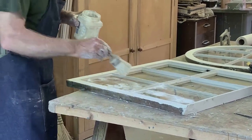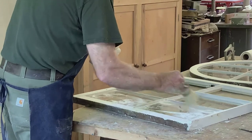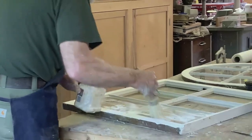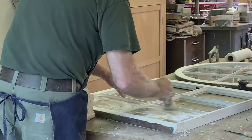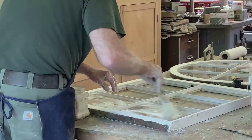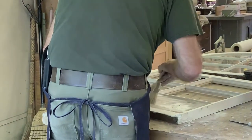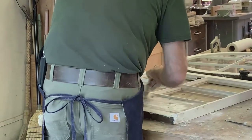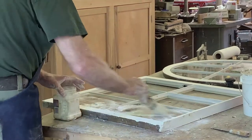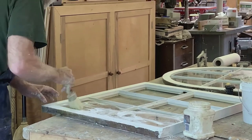This is the whiting again. You do this to dry the linseed oil, and you can't be bringing water to the putty for a while. You end up with this stuff and it comes up a lot easier with the whiting — you clean it right up and the oil gets absorbed by the whiting, and that's it.